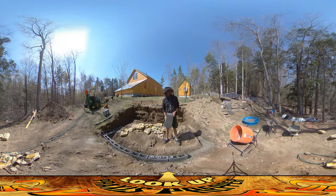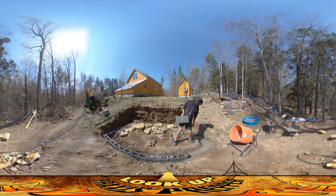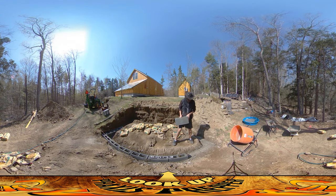So far so good, it's going pretty well. I've got this corner over to here, down to here. Once I finish this section in this area I'll be able to do the rest of the footing, the higher part of the footing up over there. I have one thing that I have to remember in this wall and that's a drain. There's going to be a water drain that's going to go down here and then out this way. So this is the last full block that I'm going to put in here before I have to knock out a section of block in order to put the drain through.